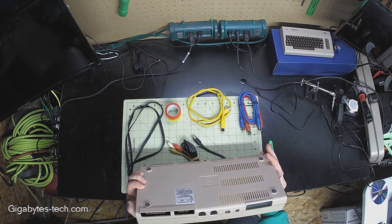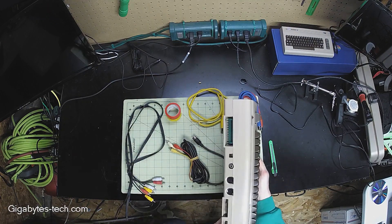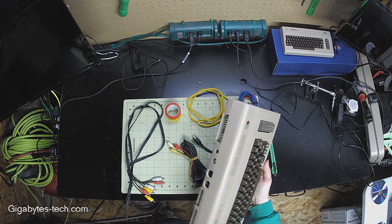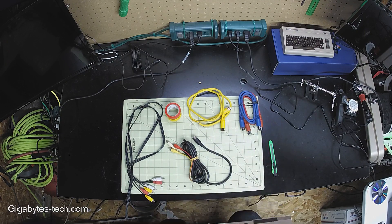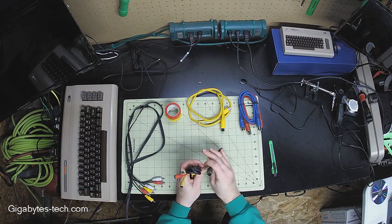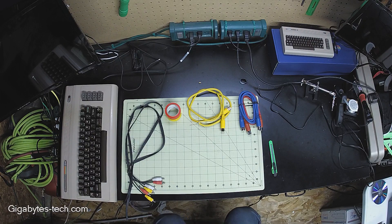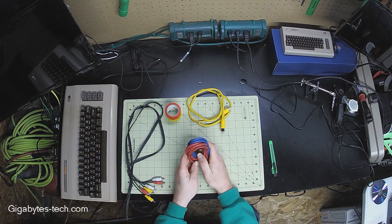The board in here is an older board. So far, the only way I've been able to use it is through the TV RF-out — the RF modulator. That works okay, but I want to try and get some better video off of it. Because this is 8-pin, this cable won't work. I could order one online, but I figured, what the heck, I might as well just go ahead and build my own.